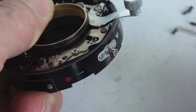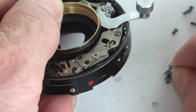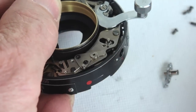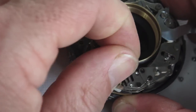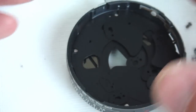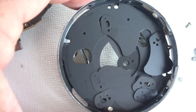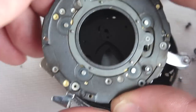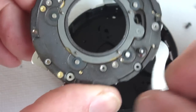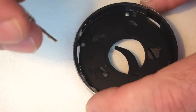The flash socket will need to be removed so that the main shutter plate can clear the end post. For now, the main shutter plate can be taken out as a unit, but before reassembly additional parts will have to be removed. The main plate mechanism is at least functioning properly. Dump the loose shutter blades to proceed to the aperture unit.